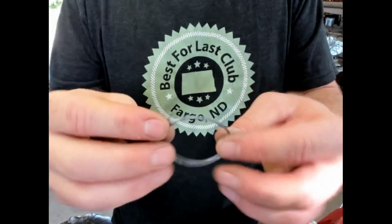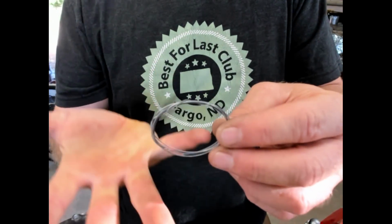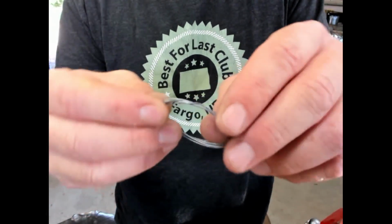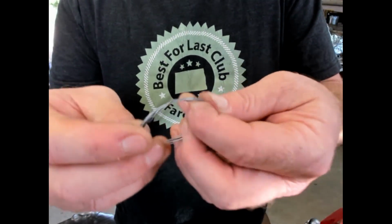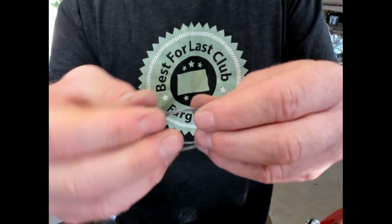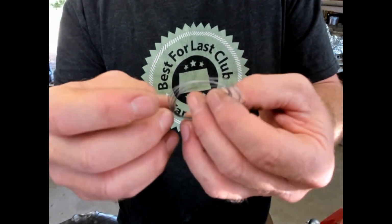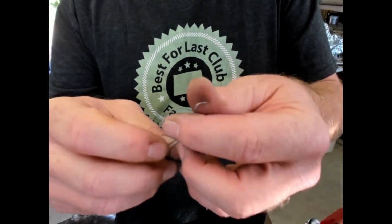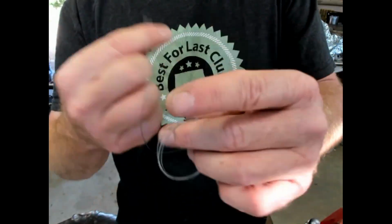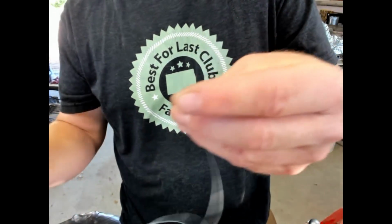But you can see when you're heating it, you can see the coil kind of start to relax and just lose that hardness, which is pretty cool. So yeah, it's nice and soft. It doesn't have that spring to it. It's wanting to keep the form, or not keep the form, rather. So there we go.